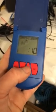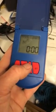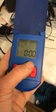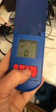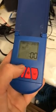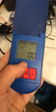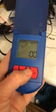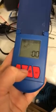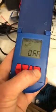10 seconds is the optimal flush duration. Press set once. Now this is where people get confused — the next flashing values are still part of the on time, but these are minutes, not seconds. You want to keep those at zero. Press set again — we're still in the on part and the hours are flashing at zero. Keep that on zero; if you put it on one, it's going to flush for one hour and 10 seconds. So make sure they're all zeros.